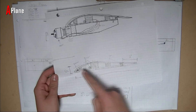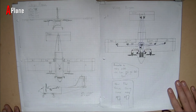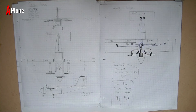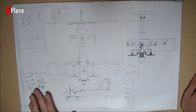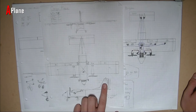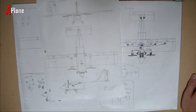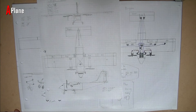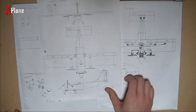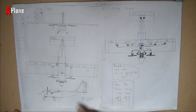This is also just a design for the wing of what it will look like. So then here's my next design. I was thinking about lengthening the wing to make it bigger, so this one is a 75 inch wingspan with a still 13 inch cord. And I changed the elevator and the horizontal stabilizer to be underneath the vertical stabilizer, so it was not a T-tail anymore. I like that better — I think it will be stronger and I won't have to worry about making the vertical stabilizer really strong to support everything on top. And this also has the idea of having the rubber bands go into the wing to hold on the motor pods.